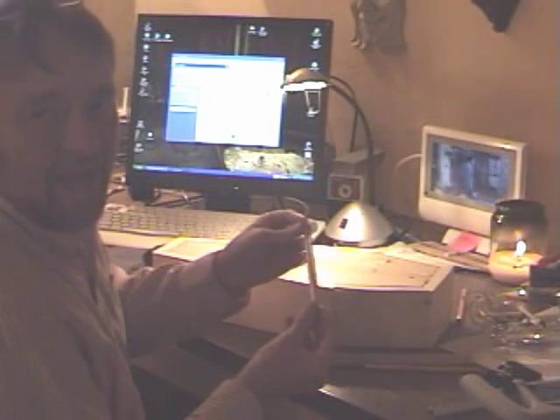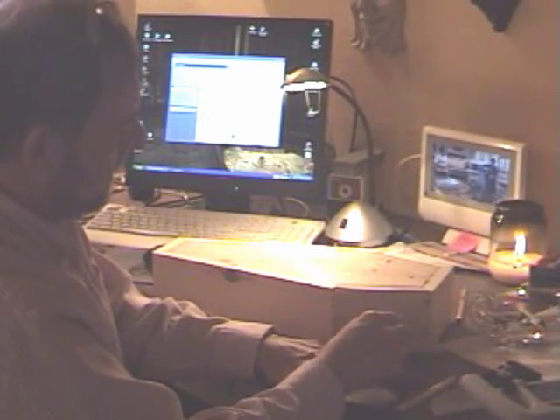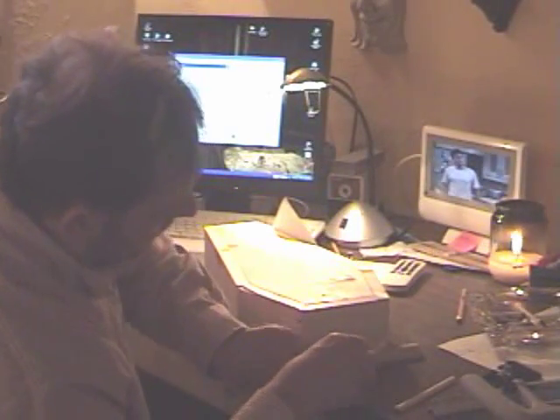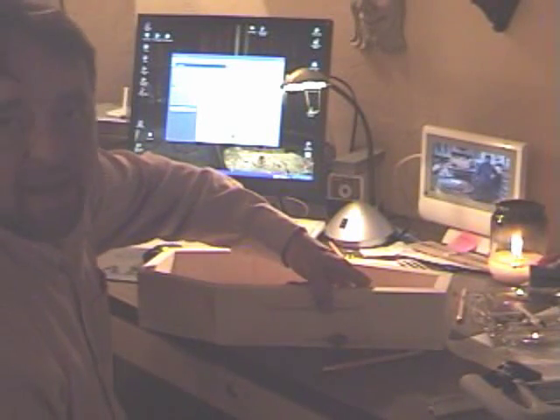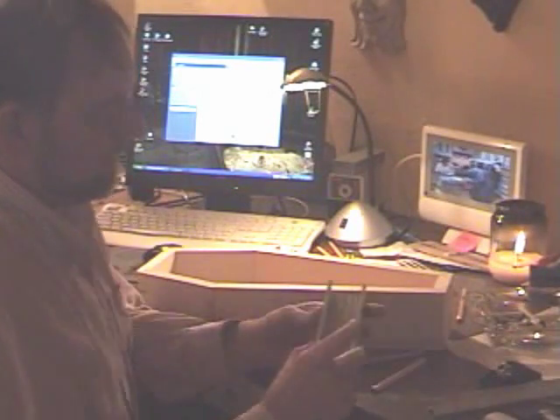For this smaller coffin, I'm going to use a half-inch half round. With the quarter round right now, I'm just going around both the top and bottom, marking a straight line — since we know it's three-quarters of an inch, it's faster than using a ruler. I'll mark all the way around the top and flip it so I've got a line where I'll hook my quarter round to give it a panel look.